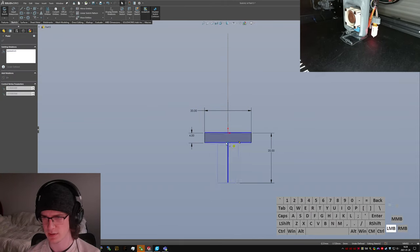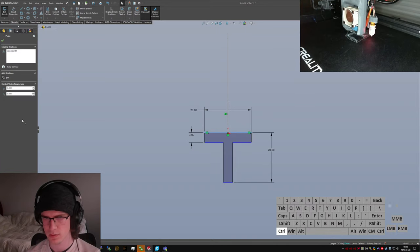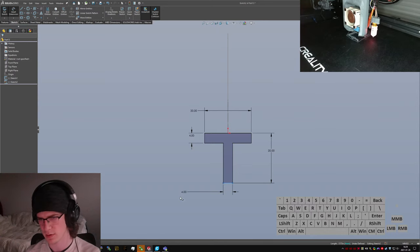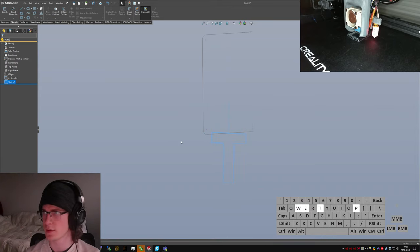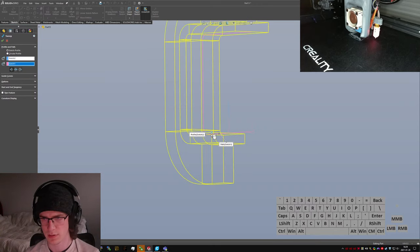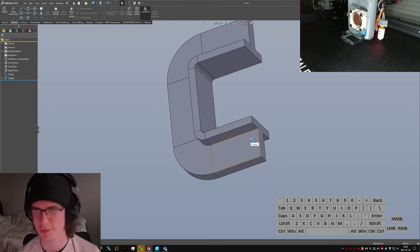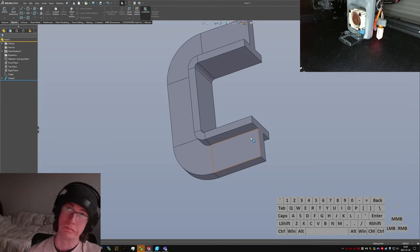Whoops. Things have gotten slightly crossing here. Make those equal. Make that coincident. Actually, I don't want those to be equal. I think I want this to be a little bit wider. Like maybe 6 millimeters. Sketch, swept boss base, and then this whole guy, both directions please. Except that's not going to work because I need to have clearance for the fastener. I think I have an idea how I can do that though. Maybe?